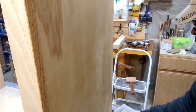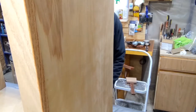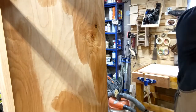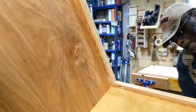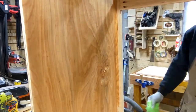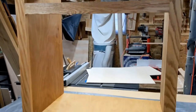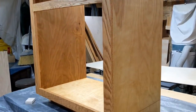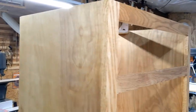Now I'm adding some pre-stain to the box and the face frame. I'm going to use oak stain on the entire thing so it'll have a nice uniform finish — the pre-stain helps to prevent blotchiness, mostly in the plywood. I noticed I've got the sides reversed; they should have been on the outside since no one will see the outsides of this cabinet, but we will see the inside every time we open the door. Either way, the finish and the grain pattern is really neat and it still looks nice. That's the first coat of stain after the pre-stain, and I think it turned out pretty nice.